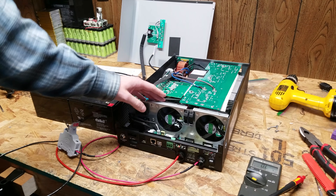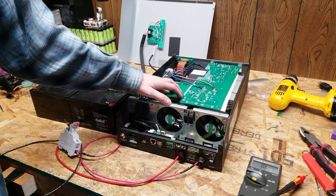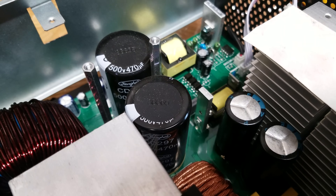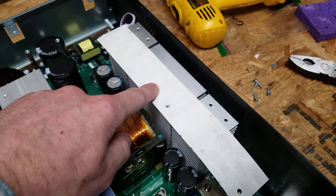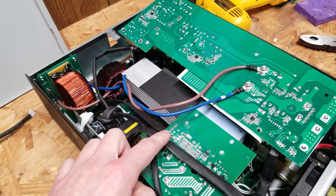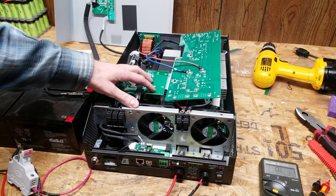I didn't see any other bad parts anywhere that were visually damaged. This kind of goes beyond my level of understanding at this point. So I wanted to post this video and ask if any of you guys know what I might check in addition to what I've already replaced. The battery input goes straight into these capacitors — they don't appear visually damaged. There are two more over here, and I believe those large ones are for the MPPT, not related to the battery, but none of those look damaged. There's also a whole line of transistors on the right side of this board that I believe were related to the MPPT. The only other thing I personally think it could be is that I only replaced five of the nine MOSFETs — even though the other four tested good with the diode test, perhaps they're stuck open. Do you think I should try replacing the other four MOSFETs and see if that helps?